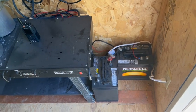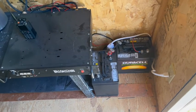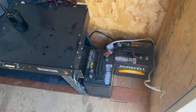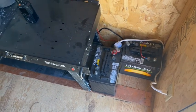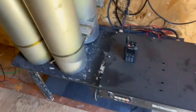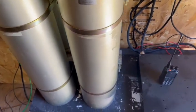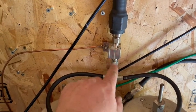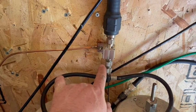Even though the building has a generator, they didn't tell me I couldn't put batteries in, so I did. I'll cover those over with some wood so nobody drops anything on them — so there's backup batteries. There's the repeater, there's the cans, the duplexer. And there's a polyphaser for lightning protection. This building doesn't really have much in it for a wide copper strapping going to ground.